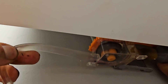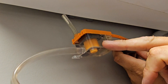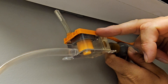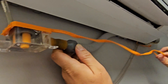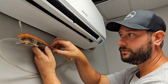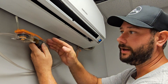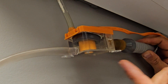Whenever you have a mini condensate pump, you have something called a reservoir, and that reservoir has a float. Whenever the reservoir gets filled with water, it lifts the float, and that's connected to a sensor cable that connects to the pump. When the float lifts up, the cable sends a signal through the sensor cable to the pump and the pump kicks on to pump the water out. Right now it's not pumping the water out, so we have an issue.